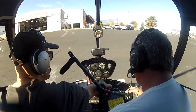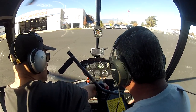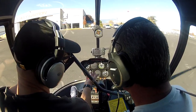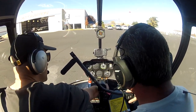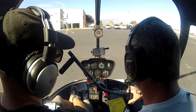So we'll get it stabilized back at 75. It should do that on its own. First thing we're going to do, two clicks, 1,000, 2,000, back to both. Now we want to make sure it's less than 7%, but you also want to remember that was about a 3% drop, wasn't much at all. Next time we do one click after it's stabilized, 1,000, 2,000, back to both, and about a 3% drop there too, well below 7.